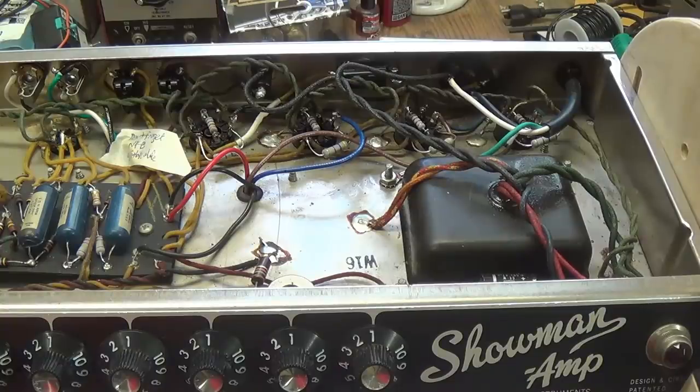Now, I know that impedance is really what matters with a transformer, but you cannot just ignore the fact that the DC resistance and essentially the length of winding of one of the half windings is over 50% greater than the other.